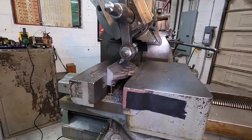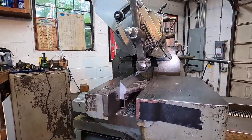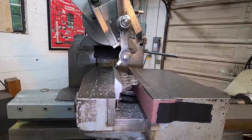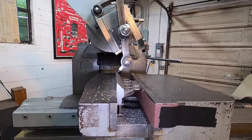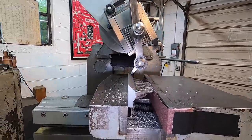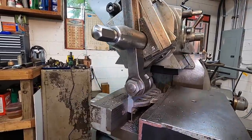This is my third and final pass on this angle — a total of one-eighth of an inch after we touched off on the bare surface. It just barely left a little bit at the top corner, just enough where I can run the file over it a couple of times and make a flat right on the peak of it. This should be my final cut here.